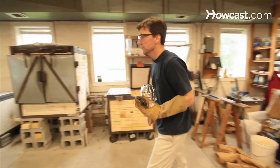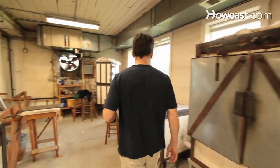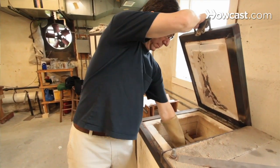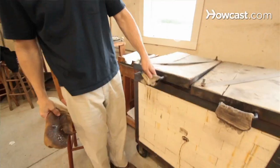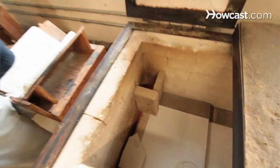You don't want to force it, so you've got to really heat the glass up to move it. Once you're finished with the piece, we'll put that glass away in the annealers, which are around 900 degrees Fahrenheit. We'll turn those off at the end of the day, allow the glass to cool slowly overnight. By the time we come back in in the morning, the glass in the annealer should be around 200 degrees. We'll lift the lids, let the glass cool down a little bit further so we can actually handle it safely. We'll put those pieces away, we'll sign them, and we'll start the day off again — we'll light the annealers, we'll light the glory holes, we'll bump the furnace up to a little bit higher temperature, and we're back to that 2,000 degrees again and working in the studio.